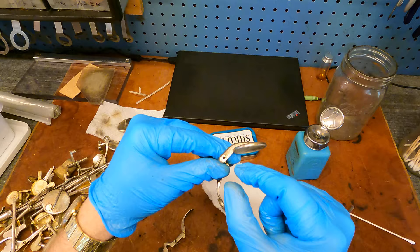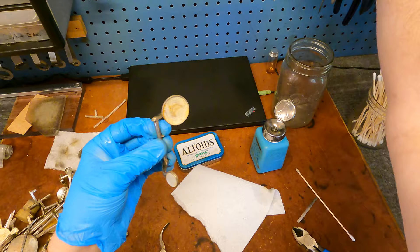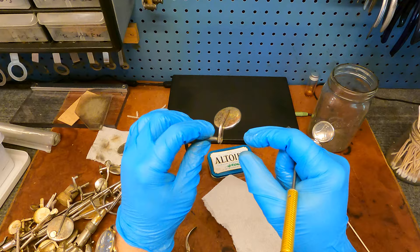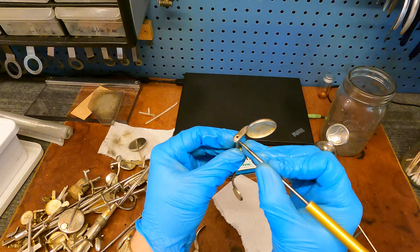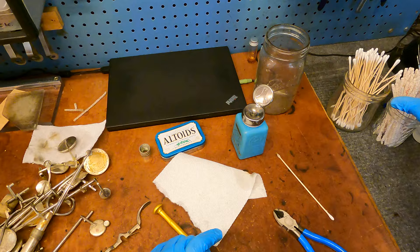It looks shaped — it's got a matching taper on the inside to the pivot screws, but also a really long, large hole drilled deeper. So the pivot screw goes in to about here, then there's a long drilled section beyond that. That can be an oil reserve. Also, when you screw it in, if it mates really well it can actually pressurize — since liquid doesn't compress, if you don't have a little repository in the bottom you can get a kind of hydro-lock. So usually there'll be a small reservoir in the bottom to prevent that.